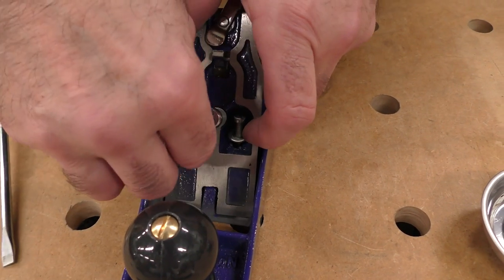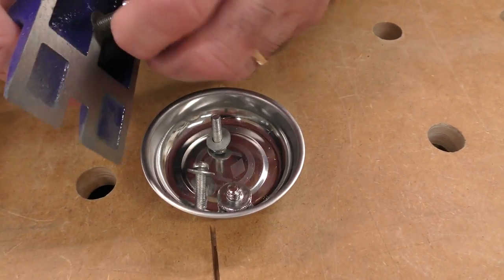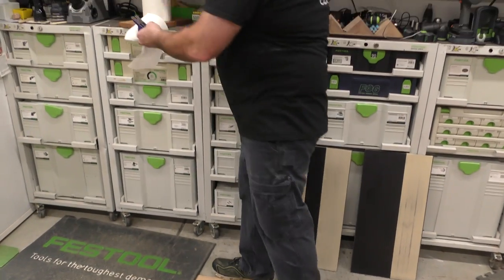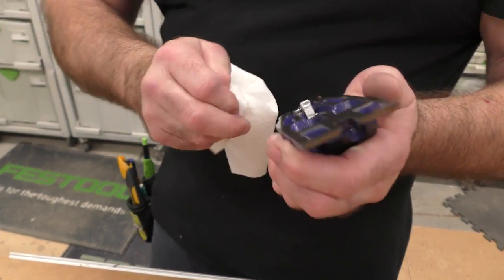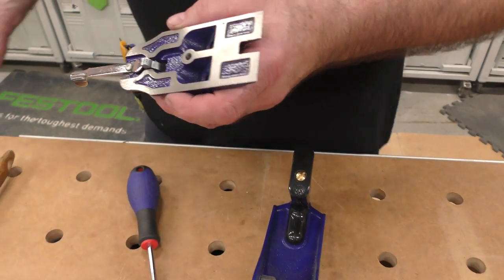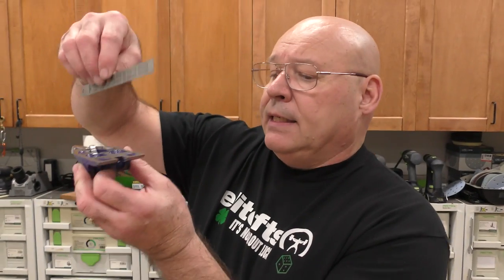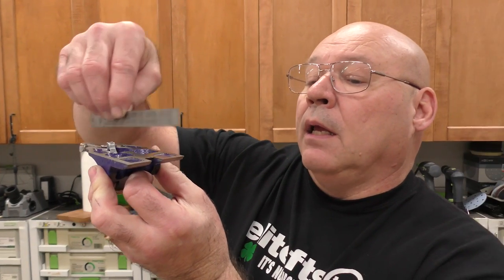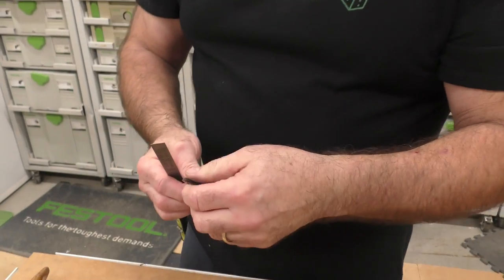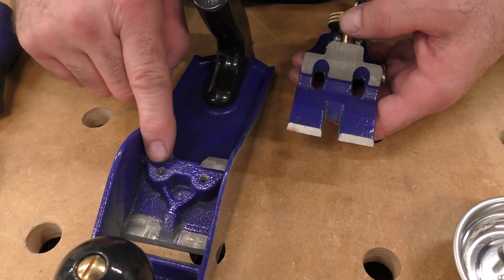Big D wants to learn about all kinds of hand planes. I'll take this lever cap screw off too. Always make sure you have plenty of paper towels. Especially if it's an older hand plane from a garage sale — I always descale this piece; it's really imperative that it's dead flat. I take a good straightedge and check the whole thing — amazingly this is actually ground. I don't need to touch this.